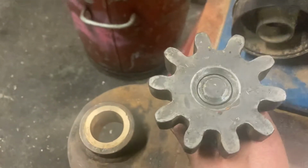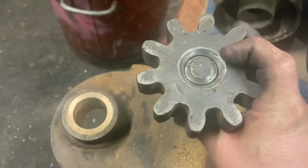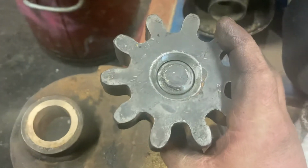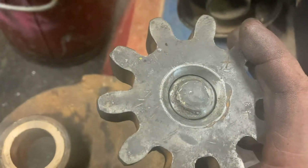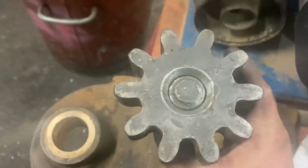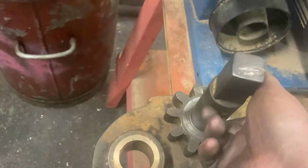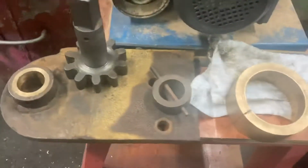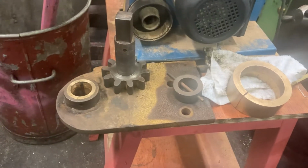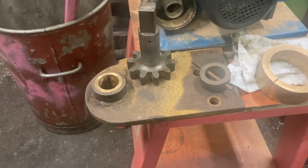Now, the pinion should be held onto the end of the shaft by weld. That weld had broken, so what I've done is machine the old weld out and put a 45-degree chamfer in there to act as a weld prep. And so then tomorrow one of our welder types, probably Tom Lee, at a guess, because the incredible Dougie Foster isn't here and Jules doesn't work Fridays. So we'll get Tom Lee to stick that back together for us, and then that can be done.